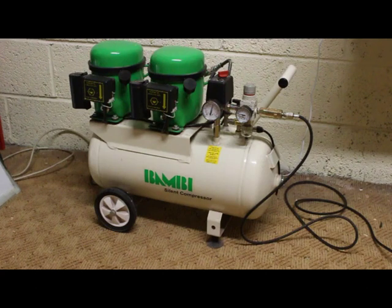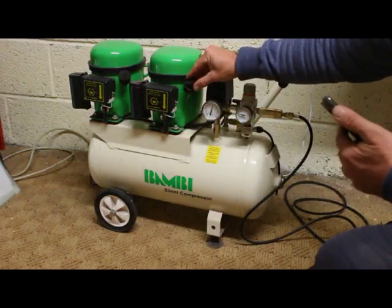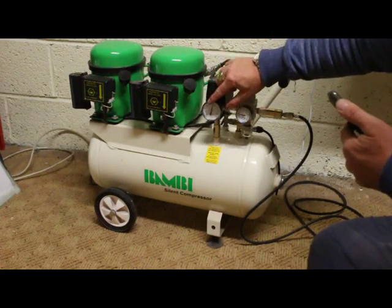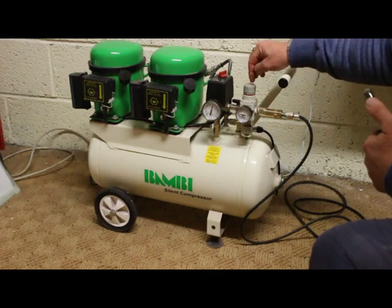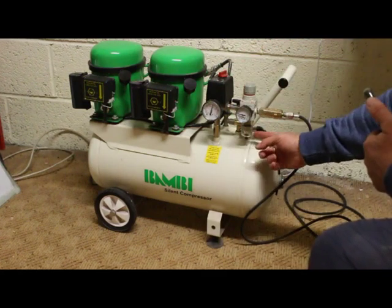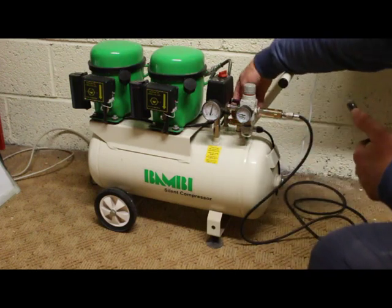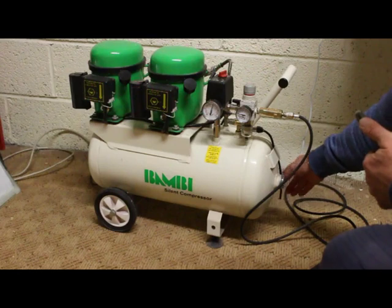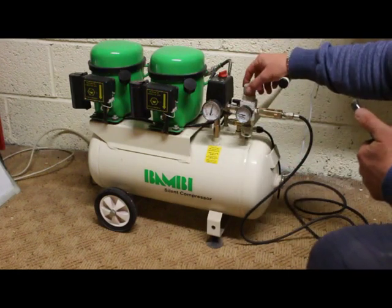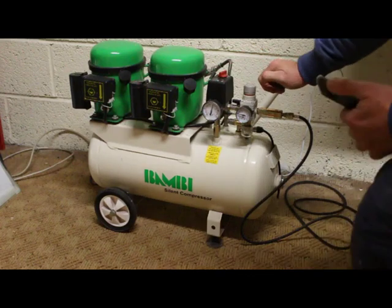It's 240 volt, runs at 1320 watts, does 100 liters a minute, 50 liter tank, and has a maximum pressure of eight bar. This particular one is oil filled — we have oil levels here which have to be checked regularly. We have a little air filter, the on/off switch, the pressure that the tank is under, and the on/off air switch which shows the pressure we're running the airbrushes at. Underneath there is the moisture trap filter. There is also a little tap — if we open that up it empties the air out of the tank, getting rid of any moisture. That has to be done on a fairly regular basis, maybe once a week. So that's the tank I'm using every day.